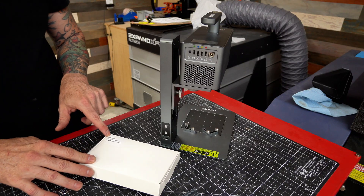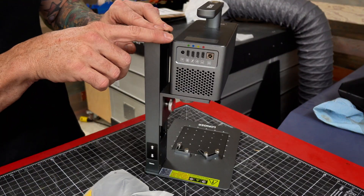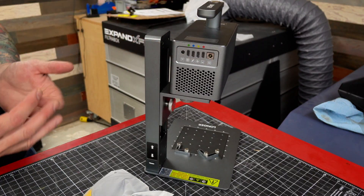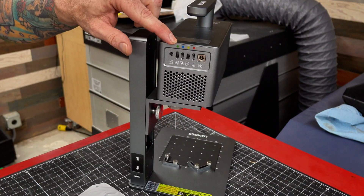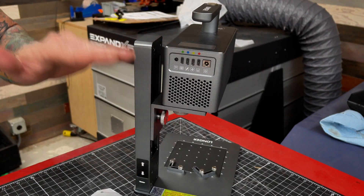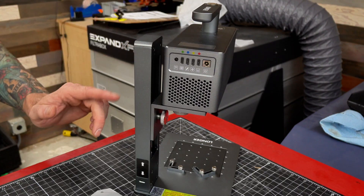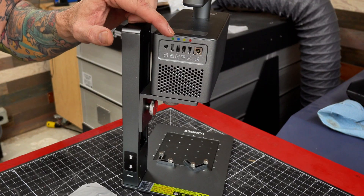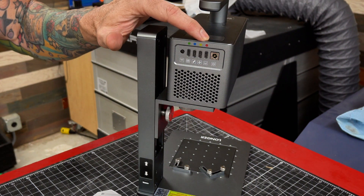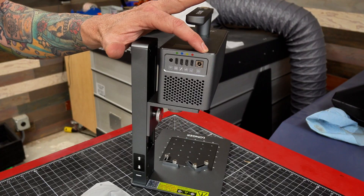Go ahead and locate the box that has your data cables, open it up, and remove all of those cables. Longer has done a great job labeling the backside of this unit, taking any guesswork out of how to run these wires. The green port controls the exhaust fan. This small unit has an automatic up and down — commonly referred to as your Z height adjustment — and the blue cable supplies power to that automatic column. The yellow port is for accessories such as the rotary attachment and slide. The red cable goes to your PC, and on the far side is your standard power connection.